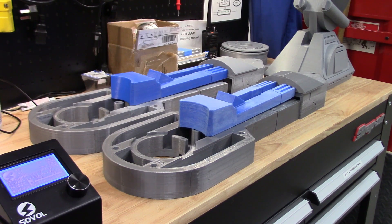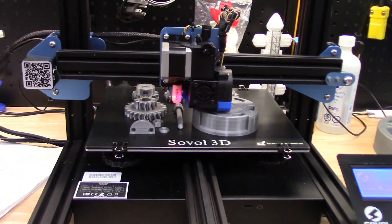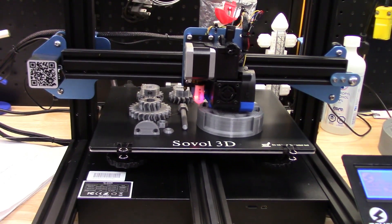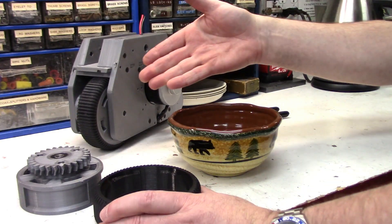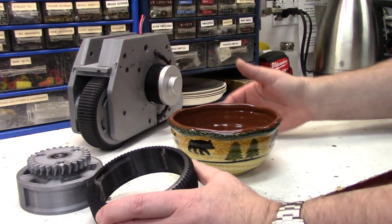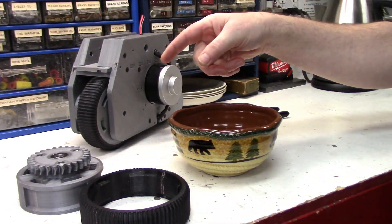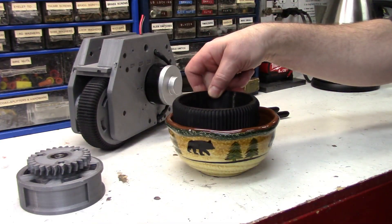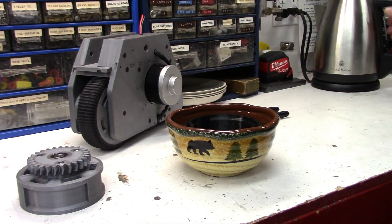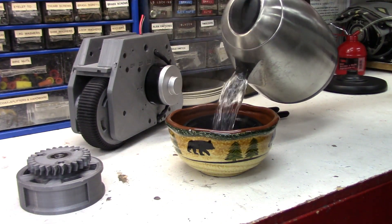The main leg components are finally finished and glued together, so today we start on the feet. Lots of parts to them. Fitting the tires to the wheel hub is kind of a challenge — it really depends on how flexible your TPU is. This stuff I'm using is pretty rigid. To fit the tire, the best thing to do is soak it in boiling water for a while, and that softens it up. I've never had TPU tea before, but there's a first time for everything.